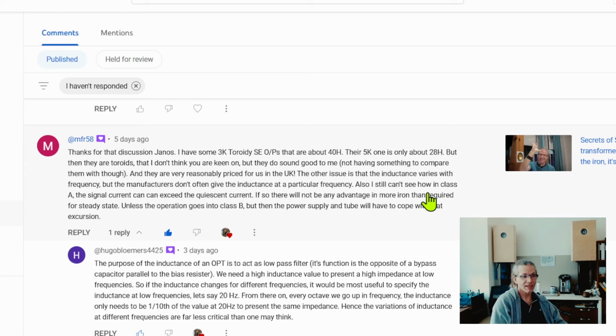Or actually, it doesn't mean that they cannot have one, it's just that the models you find in amplifiers, those power transformers, are not gapped to allow any kind of DC current to flow through them without saturation, which today in our modern world is happening all over the place. So when you have a power transformer in your amplifier that does not take into account the possibility of low levels of DC current running through it, you are going to run into a major problem. And that problem is saturation.